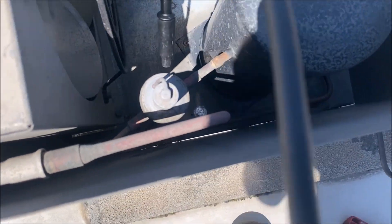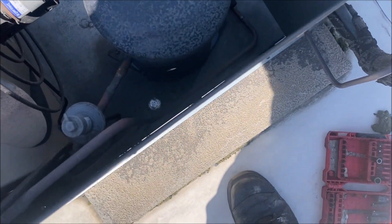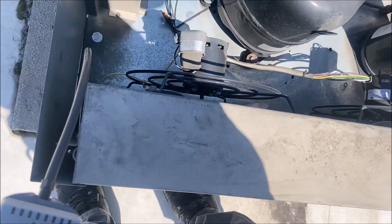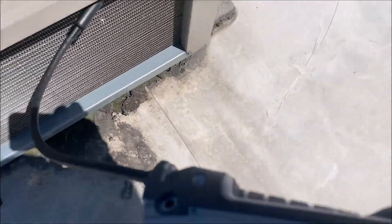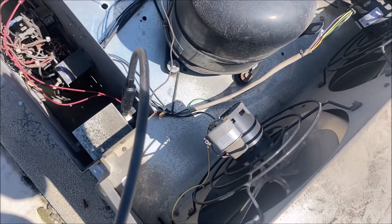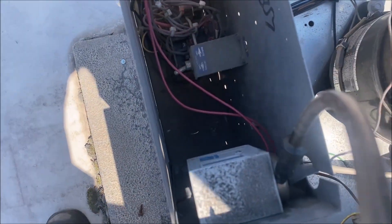Let's come up here and hit up our headmaster — see if any of those joints are leaking. Still no luck. Let's go hit up our condenser; it's pretty rare we see a condenser leak, but in this case I'm pretty desperate. Let's go hit up the face of the condenser and see if anything's hidden here. So far no luck — but then we got a hit. This is good news.